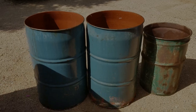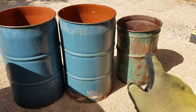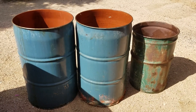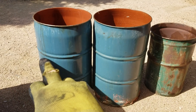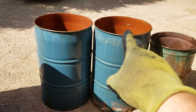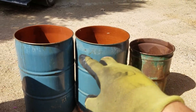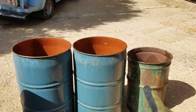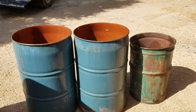What we're going to need is three barrels — two 55-gallon metal drums and one 30-gallon metal drum. We're going to drill holes in the bottom of one, cut the other so it can sit on top with a little airflow, and then the 30-gallon goes on top as the chimney or smokestack — the afterburner.